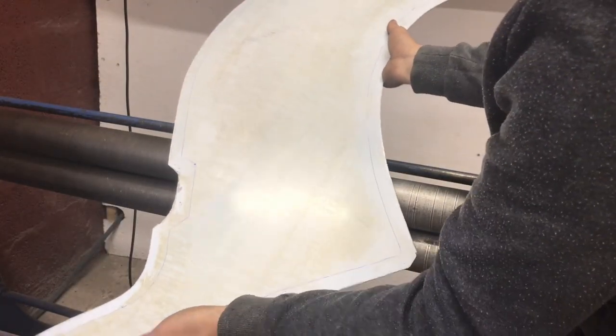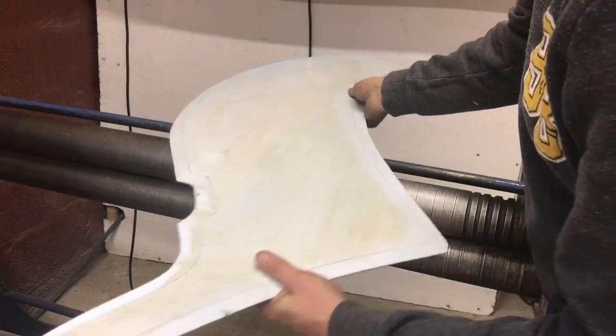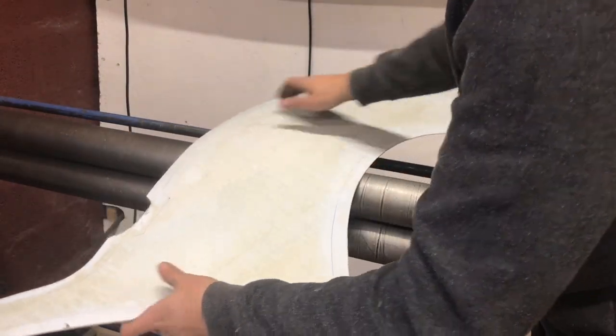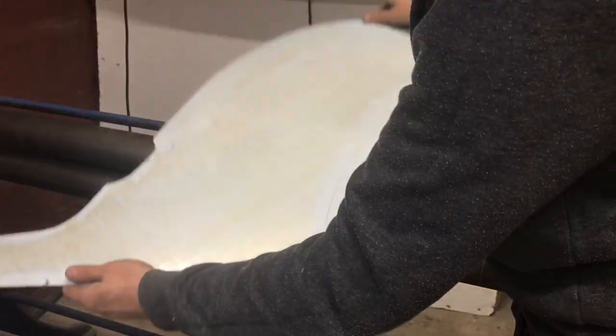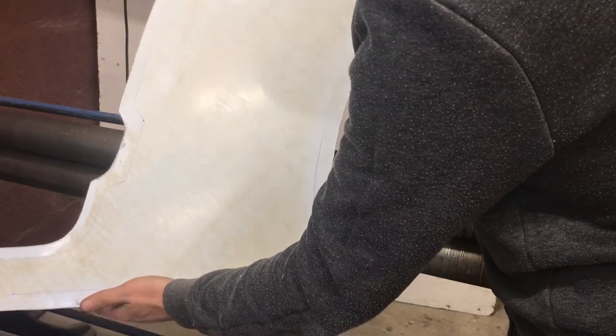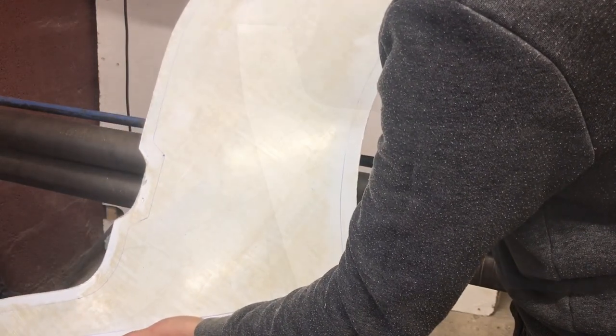There's the panel. Excuse all the brown, I'll wipe all that off. That's just like rust and everything that's on the rollers. But if I go and get a rule and show you how much shape is in there, obviously this will flatten off. I know it looks a bit excessive, but this will flatten off once I offer it up to the ash frame and start knocking my edge over.